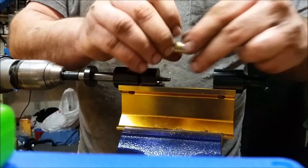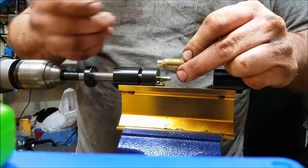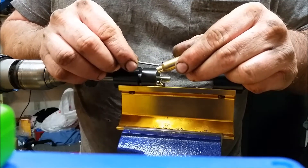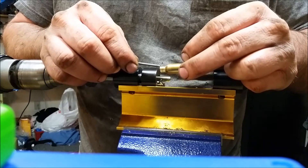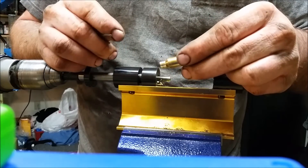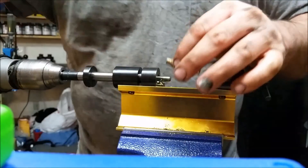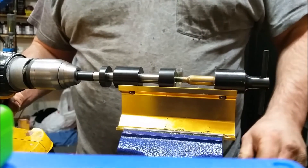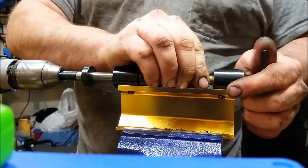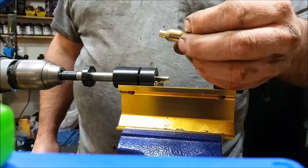Voila! As you can see, I cut into the shoulder here — it leaves just a little bit of ridge. I wet tumble, so it cleans it off, and when you fire-form it'll take that out. As you can see here, there are some spots where it doesn't touch. If you want to take it thinner you can — I just do enough to get it pretty much the same. You can see the line in the middle where the old shoulder was. It seems to work perfect. It just makes this procedure so much easier. And just that easy — ready to run.